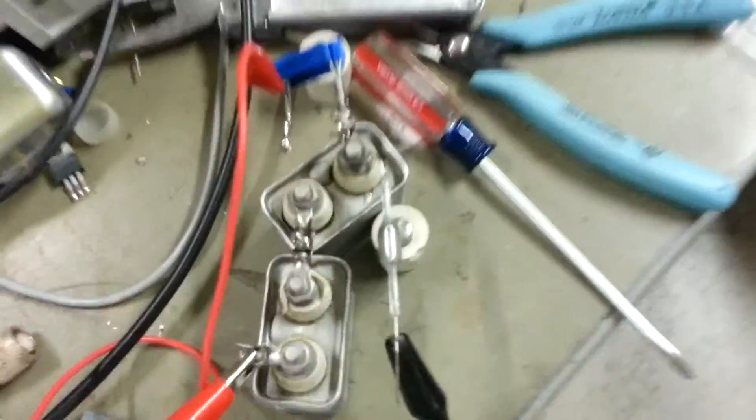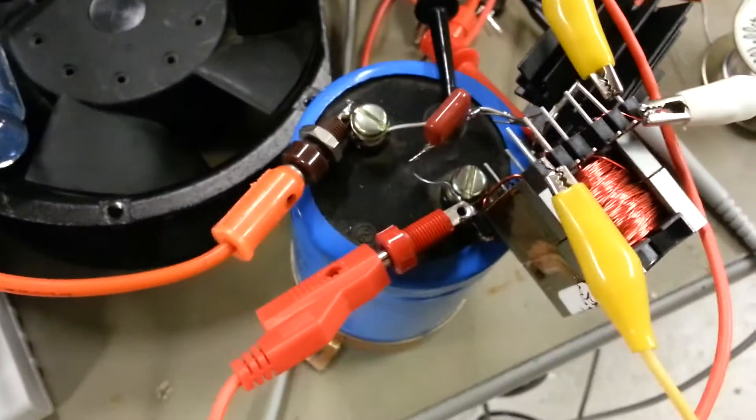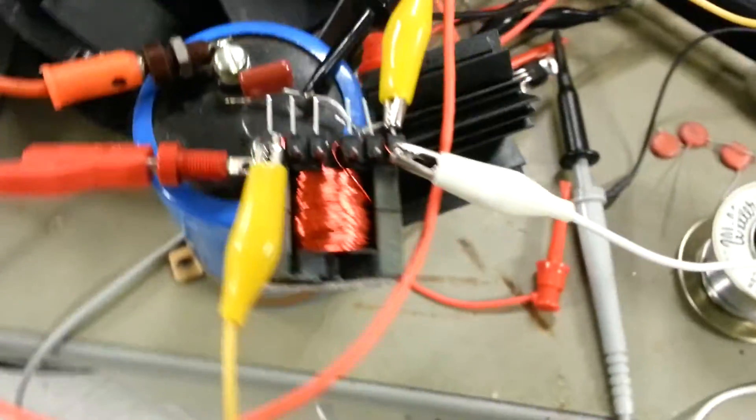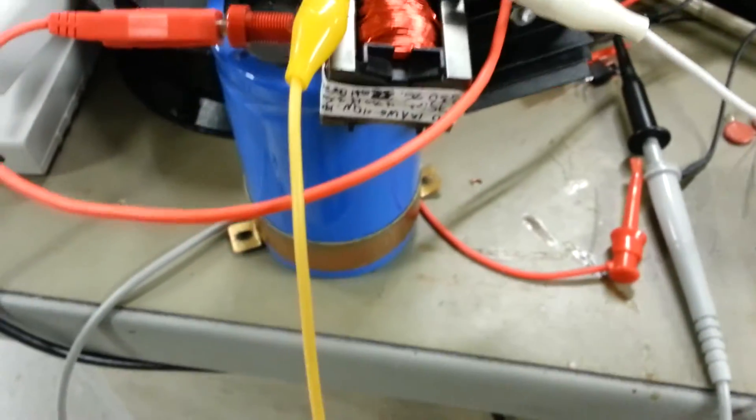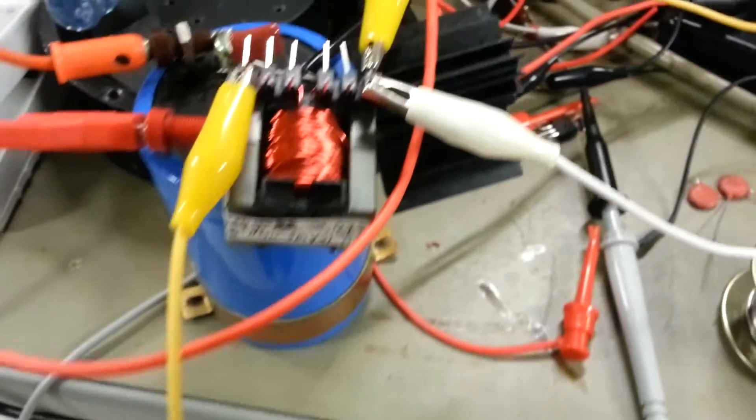This is the touchy little test circuit of the day. I have some of these 20 watt halide lamps I've been trying to get running. We have a flyback with a transformer I wound, with a ratio of inductance of about 300 to 1.